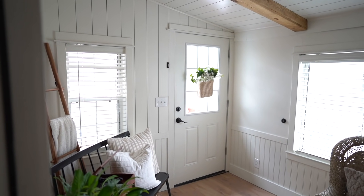Ashley's mom already had a back door picked out and ready to go. This wasn't in the budget but I had helped put in a few exterior doors before, so I felt like the room wouldn't be complete without it. It ended up being a lot harder than I thought because the original framing of this room was like a DIY from 30 years ago — the framing wasn't square, I had to mess with it and use lots of shims. Here's the door, which is beautiful, and having that extra window just brightens up the room even more.